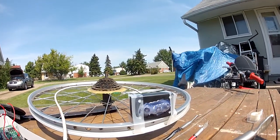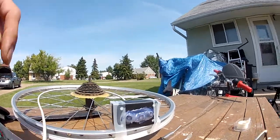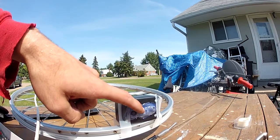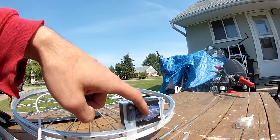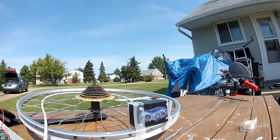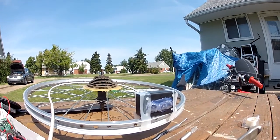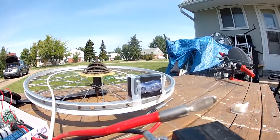The code is about nine lines. If this sensor reads greater than that sensor, we need to go one direction; if the other sensor reads greater, we go the other direction. There's a little bit in there where I'm dividing by 10 just to drop the values down so it doesn't go all crazy.